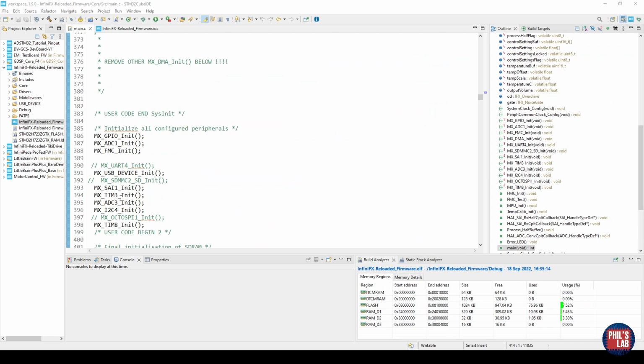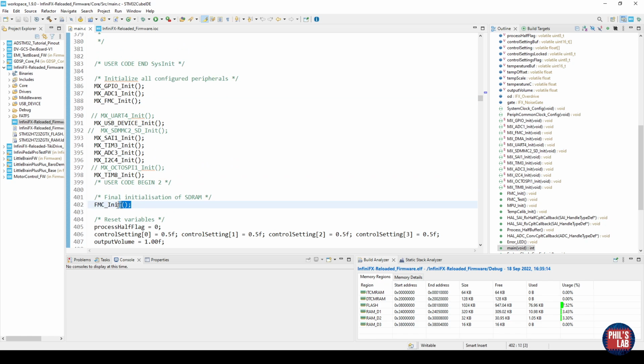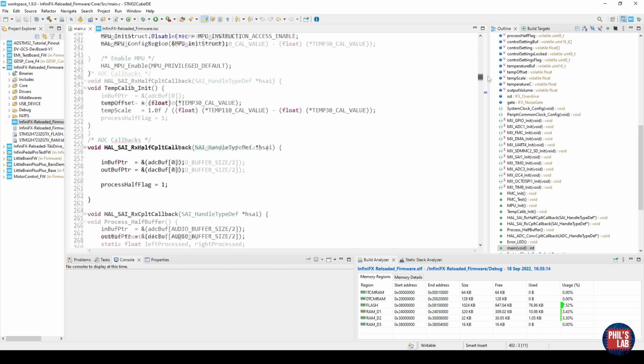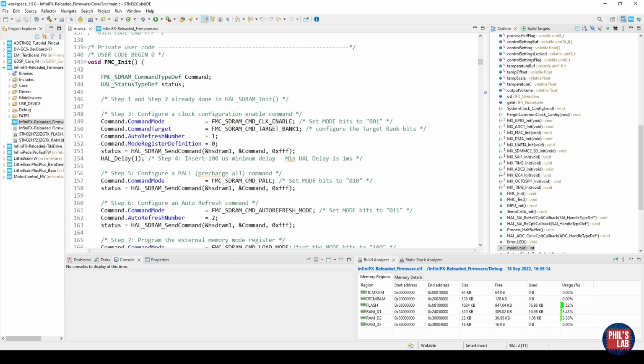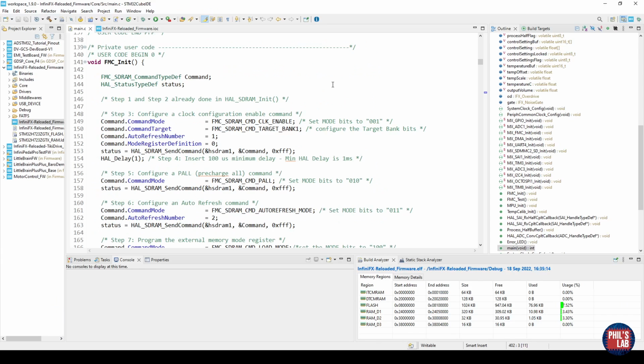Once the code has been generated, if you're using the hardware abstraction layer provided by ST, in main.c and in main, we have our usual initialization functions, and as well this MX_FMC_Init function, which initializes the FMC peripheral. However, unfortunately not quite all of it, and we have to add our own code. Down below, I've added my own custom function FMC_Init. If we go up to the function declaration, this code we have to copy in. And this is something I took from the article I previously mentioned, again linked in the description below, and you have to modify that slightly depending on your use case.